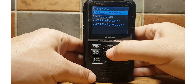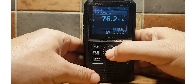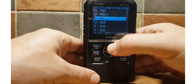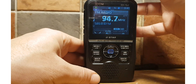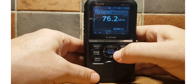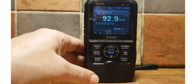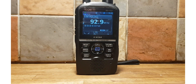Now we can select that in memory. Back out, hit FM radio, go to FM radio on, and here are our different memory channels. Hit quick to select the group you want — say group C — and scroll through the different memories you've created and named. That's similar to DR mode but for FM radio. As far as I can see, you can't scan through memory channels. So that's a bit more information on the broadcast radio feature. Thanks for watching — if you find this helpful, please like and subscribe. 73, all the best.